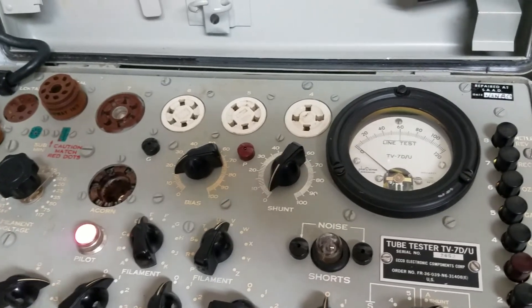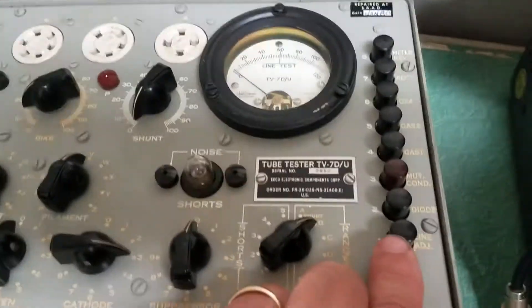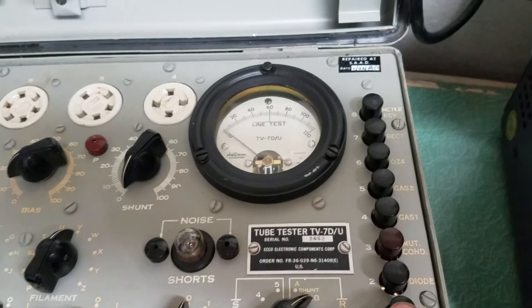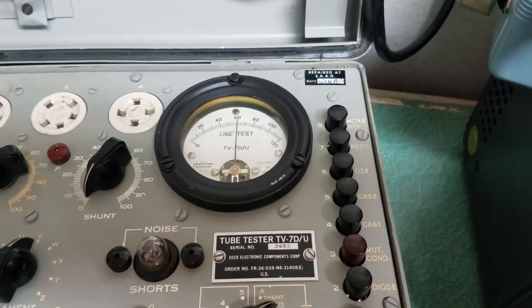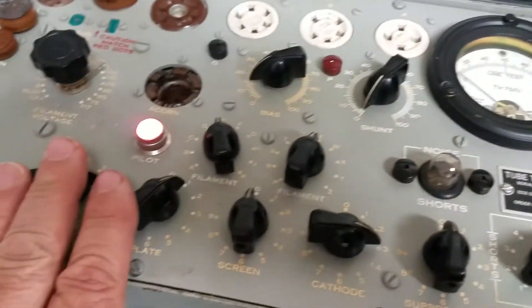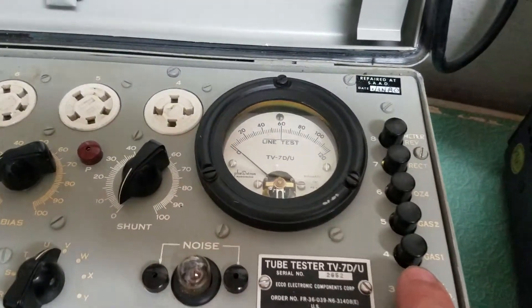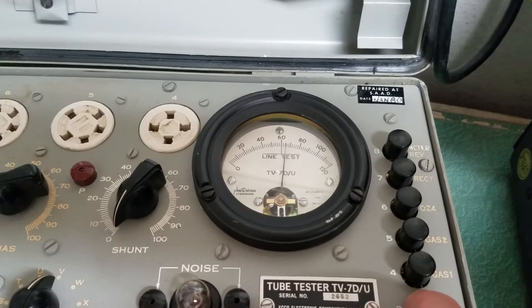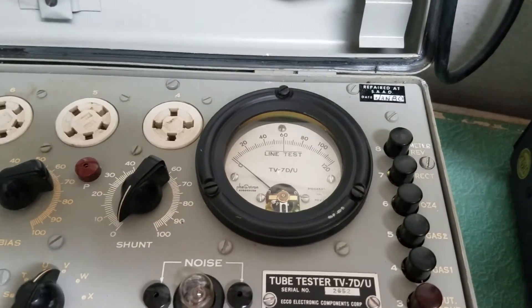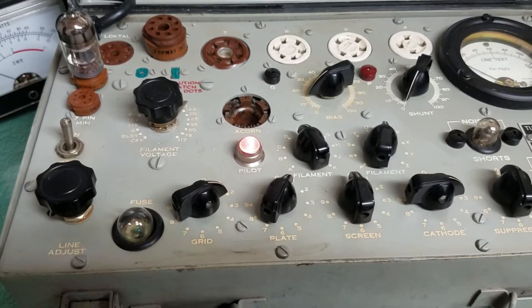This is a known good tube — it's a 12AX7 and it needs to be above 32 to be good. First I'll show you the line voltage. To check the line voltage, it's an adjustable thing. You press the button and I've already adjusted it. The adjustment is right down there. Once the line is adjusted correctly, you get the correct settings for this tube, press button number 3, and there you go — it shows about 64, maybe 65. This tube is supposed to test good at 32, so this new tube is reading well above that. That's just the one-side test.